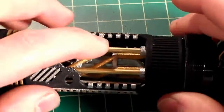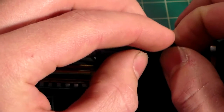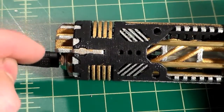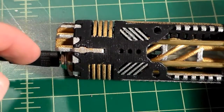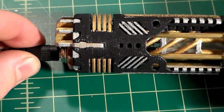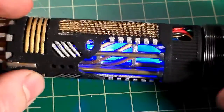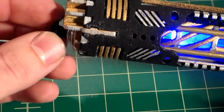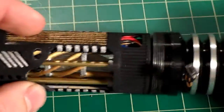As you can see, my LED goes out. I do not have power. My switch is dead. My switch doesn't do anything. So that tells me that the recharge port has cut power from the battery to the board, and I am now sending my full 4.2 volts directly to the battery. And if I remove the port or remove the charger, we get the boot up sound and everything lights back up. So we know that that part is also good. So now I'm just going to go ahead and reinstall my kill key, cutting power.